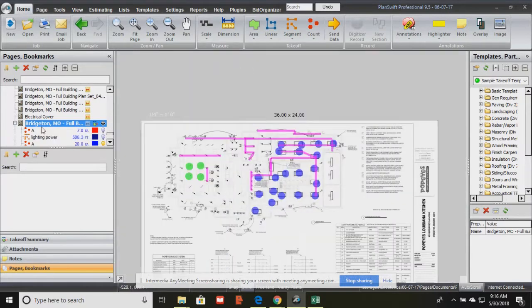So make sure you always follow the keynotes. All right, electrical set, 2 plans. We just went over the lighting plan. The lighting plan tells us all about the lights and how they're controlled. They can be controlled 2 ways, either through a lighting control circuitry, which is depicted in all cases by a lowercase alphabet, or by the panel, which means they're directly connected to a panel at a certain position. That is shown by an uppercase alphabet and the position of the panel.